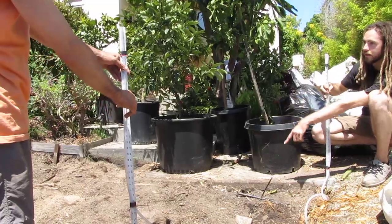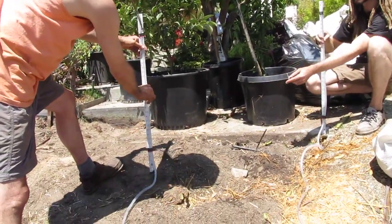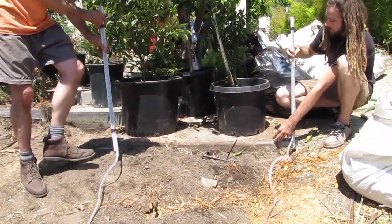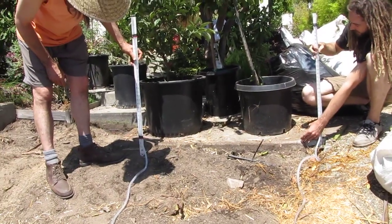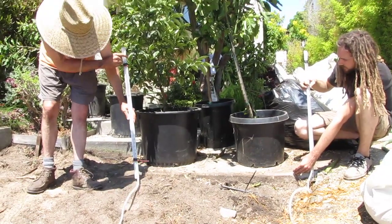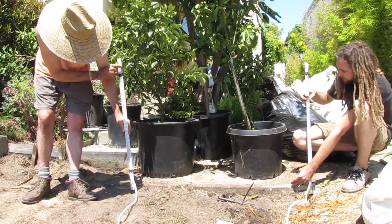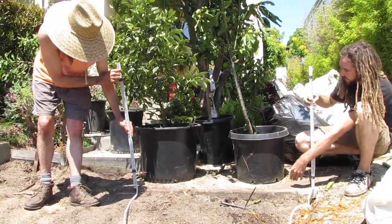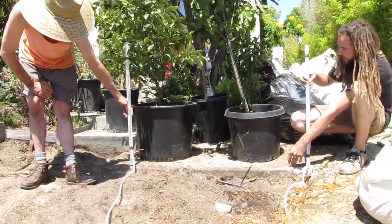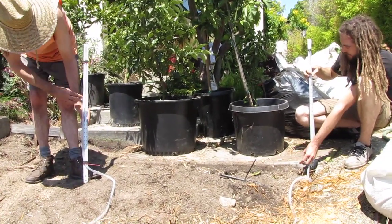We know that a level line goes upslope. Basically, you're trying to always keep that in contact with the soil, and we can probably see right about now where the level line is going to be. I'm at 23.5. Let's go up just a hair, a little more. Keep going up. Back this way probably. When you hit the concrete, that should be it. Yep, 22.5. No, I'm at 24. Must have miscalibrated. Okay, so that should be about right.